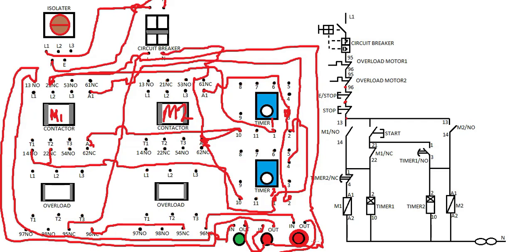Terminal 10 and the output are one thing. Timer two and A2 are the same — this one is common because it's connected to 1. Then we can take A2 here — you are taking it to neutral. And this is how you will connect this control circuit. You just need to follow and connect accordingly. This is the control circuit only — it's not even the main circuit. This is how you connect it.